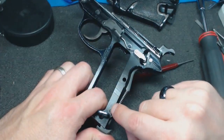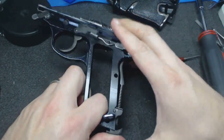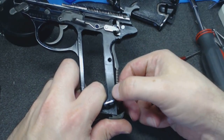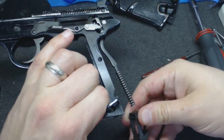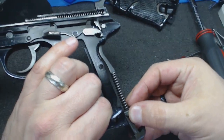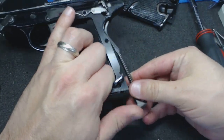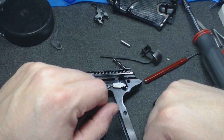The one thing that's a nice improvement for taking it apart: all we have to do is push straight up on this. Normally you're pushing backwards and it's rotating around that. But if we come straight up from the bottom, we're going to be pushing that pin and we can pop that off the frame — and it comes right out like that. As far as takedowns for main springs, if there's an easier one in the world, I don't know what it is.